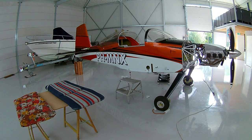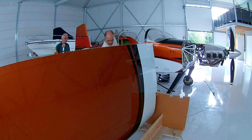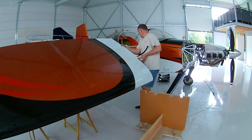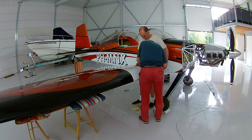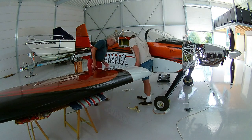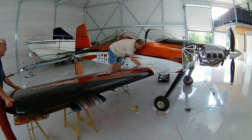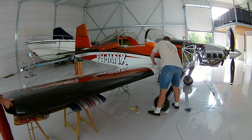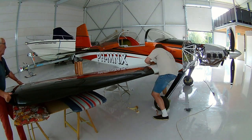Of course on the right wing we also need to route the wires through the tubing. And there is no return line in the right wing, so it is just easier. Also because we had already done the left wing, it just made it easier. Again we have to take into account the skin and also the bolts that need to go in there.